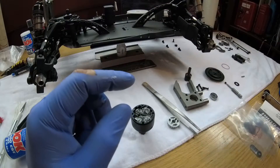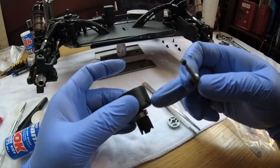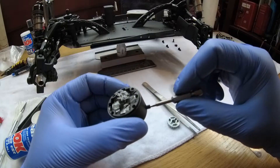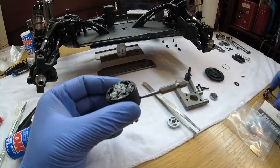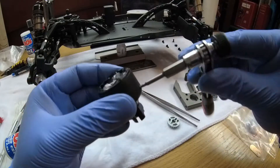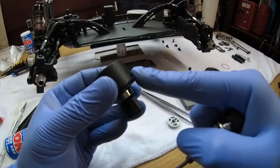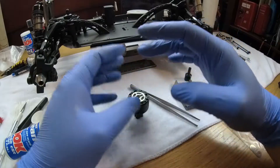What I wanted to tell you guys: don't forget your grub screw. Make sure you put that in - especially if you've got a grub screw. I can see a little bit of oil coming out, I should have put this in before. Let's put it in now before we forget completely. Don't go crazy - nice and flush. So let that sit for a while, then let's do the other side.